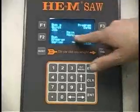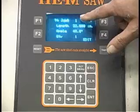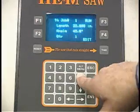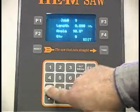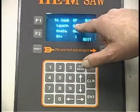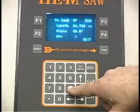You can also go back and look at job data. Job one is already programmed for one part, 22 inches. We can use the arrow keys or we can edit that. If we go up and look at job 97, this is the one I just programmed — job 97, the length is this, the angle is that.